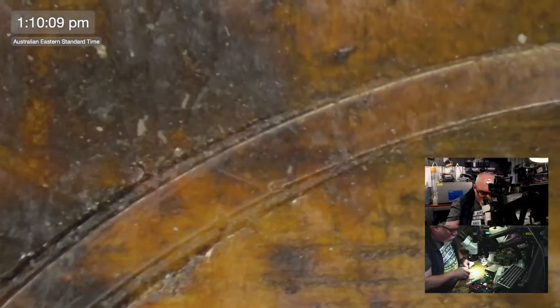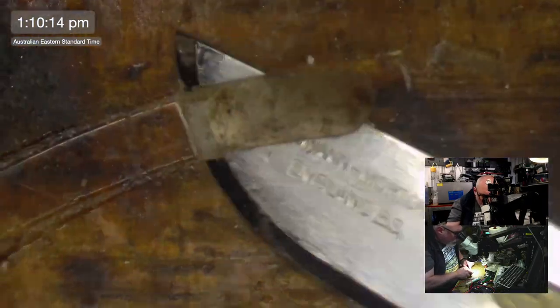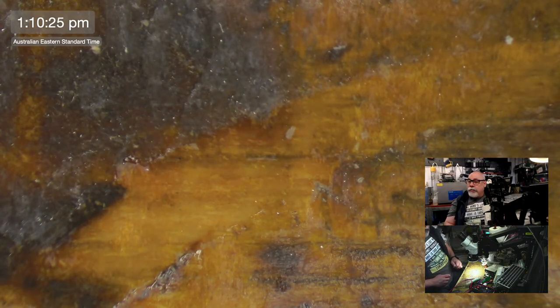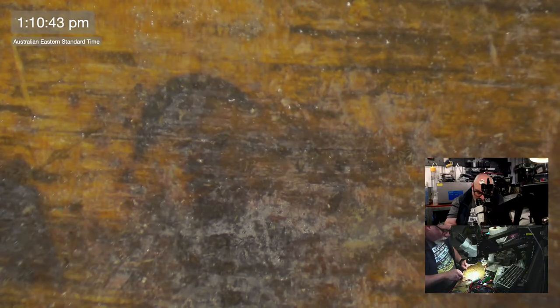Your main focus is on the continuity of the electricity. How you get to that, the board doesn't care. And I've had times where I've just ended up doing some of the weirdest, ugliest looking repairs. But at the end of the day, as long as you have a wire in place or something in place to make that electricity travel through, the board doesn't care how ugly it looks. So sometimes with those sorts of things, you just have to get creative, finding ways of getting things to work.